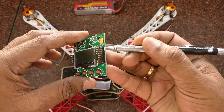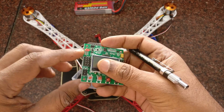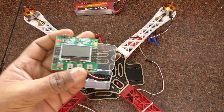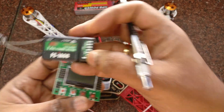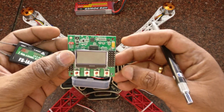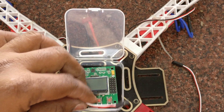At the right side edge, all pins are ground and the center pins are all 5 volt, and the first pin is signal. At the left side, you have 5 connections that are for receiver connections. Each channel can be controlled using this KK board directly. The left side is for receiver connections and the right side is for motor ESC connections.